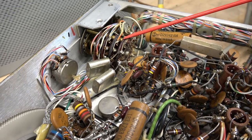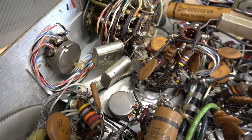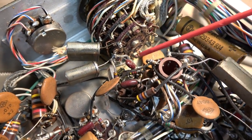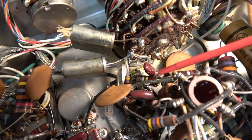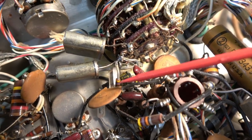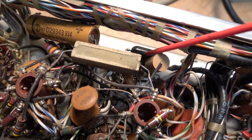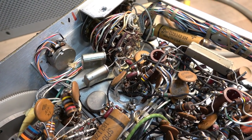Here's the alarming part. Right here is the emission switch — a multi-section wafer switch. Look underneath it. There is a bunch of goo over the chassis right down in there, and it'll come off. There's all this splattered goo all over the place. Right behind this tube socket you'll see an electrolytic cap — it's a black cap, but it blew its end out and shot all the electrolyte all over the chassis. So it's obvious that cap needs to be replaced too. I also spotted a 100 microfarad cap hiding over here. We're going to change all the caps and retest this radio and see if all those problems go away.